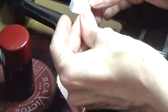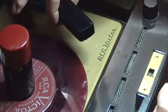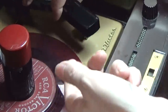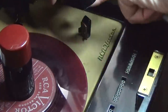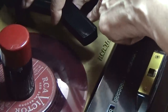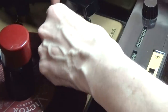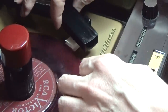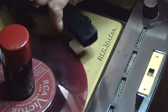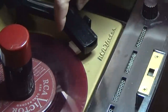One of the things I am doing is cutting a little chunk of foam core — made a little stack of two pieces of quarter-inch foam core — because the way this turntable is designed, there's really nothing to protect the tonearm from slamming down into the plate. If there's no record here, or if the mechanism's off, it can just fall right in. There's a clip you can manually hold it with, but when you're running it the tonearm has to be free because of the automatic mechanism. So I made this little block to sit in here so that if it comes off the stand, the needle doesn't just slam into the base — it'll basically just pad the cartridge so it doesn't slam down. I'm going to stick that on with a little piece of double-sided tape.